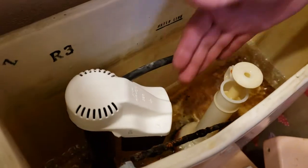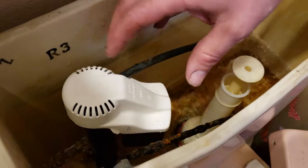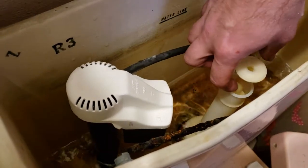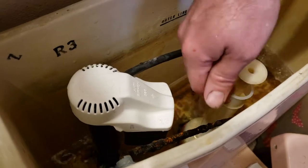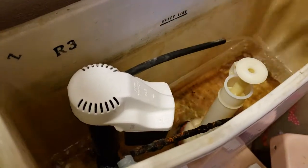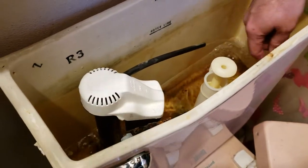It can also be this if it goes bad. Sometimes they're set up as a plunger system that's supposed to shut off, and they don't, and what will happen is it'll go up top and drain down and right through here. See that? If the water fills too high, it falls in that so that it doesn't ever flood your bathroom. Sometimes these can go bad. But 90%, that's it. See it?